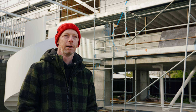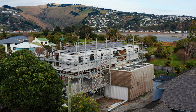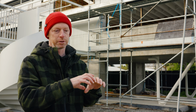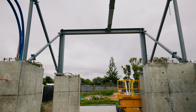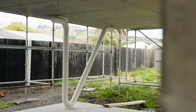It was primarily set up based on looking at how a structure might work and touching the ground really lightly. The house was set up on a structural grid so that we could reduce heavy elements out on the edges. So we've got a cantilevered upper level, which is using a large truss, which brings the load back into a central point onto 4 columns, which take it down to the ground, which allows lower levels where we've got these more curved columns, which aren't so strong structurally, to reduce your load bearing on them.